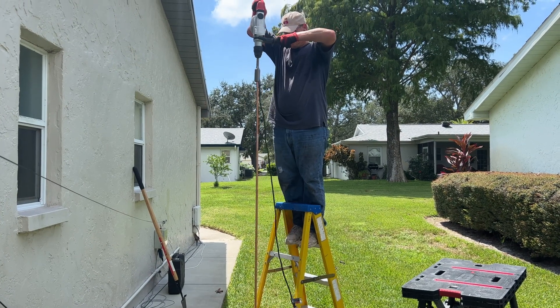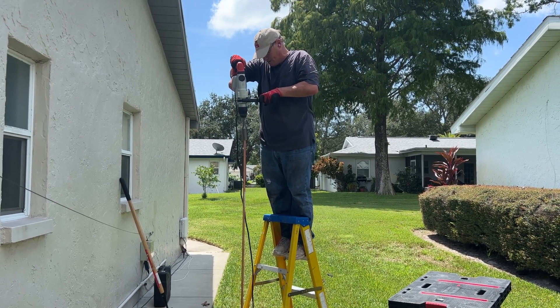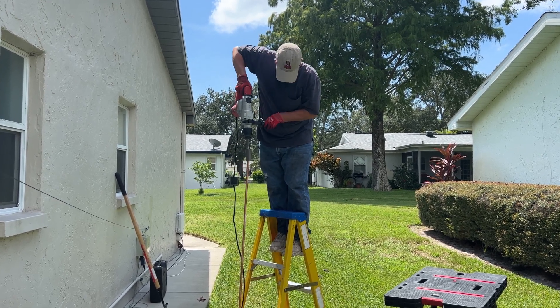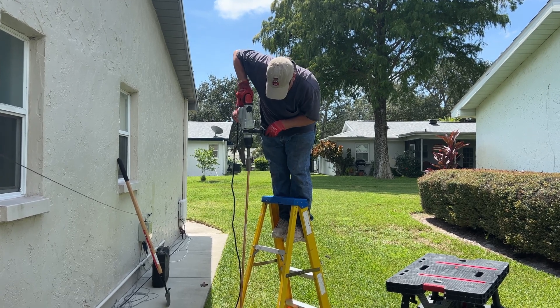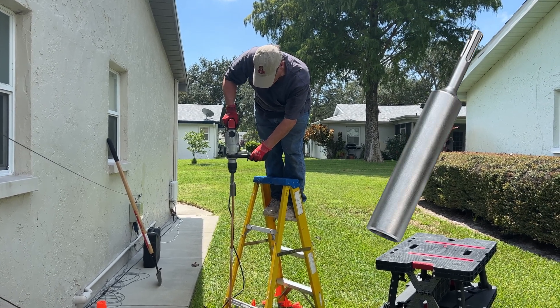Now that we're ready to do our work safely, let's do it smart. Perhaps in my younger days I would have been stupid enough to grab a sledgehammer and try to pound this thing into the ground. I'm getting a little older and the brain needs to be used a little more than the brawn these days. Even if you're younger and have the energy, I'd recommend that you rent or borrow a demolition hammer and get this attachment on the end, which is specifically for driving ground rods.